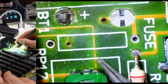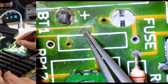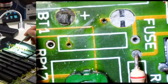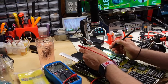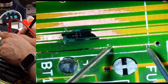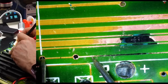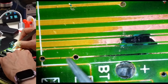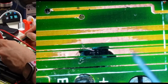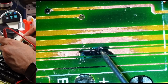I have the multimeter back on. Now that I've removed the solder mask, it's very simple to test continuity. I see there's no continuity there, but right over here there is. On the via, if I go to the edge over here, there is actually continuity as well. Obviously it goes without saying that none of this missing section is connected — there's just literally nothing there. So we have three traces to fix. Clearly all of this stuff over here is totally fine — no issues. This corrosion is pretty insidious, but now that I've neutralized it, it's not going to take over the whole board.